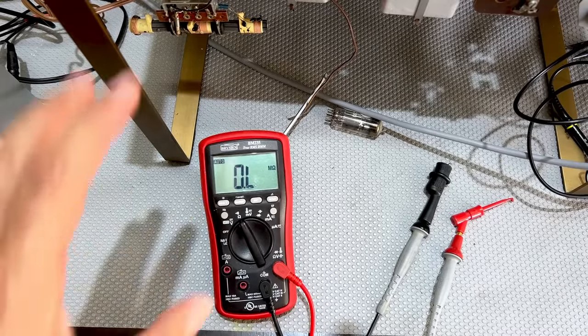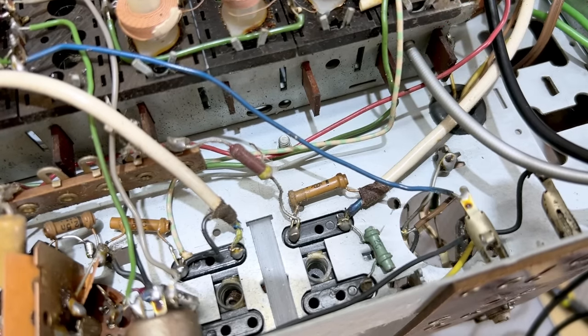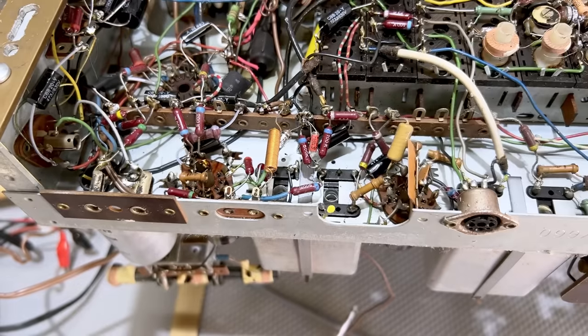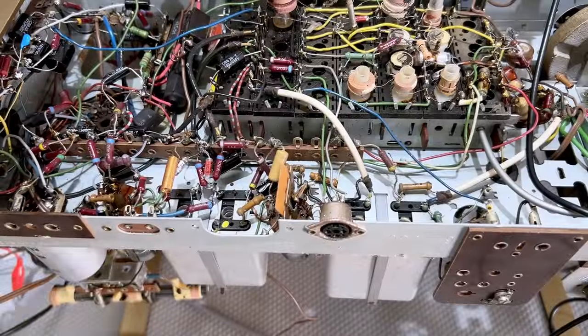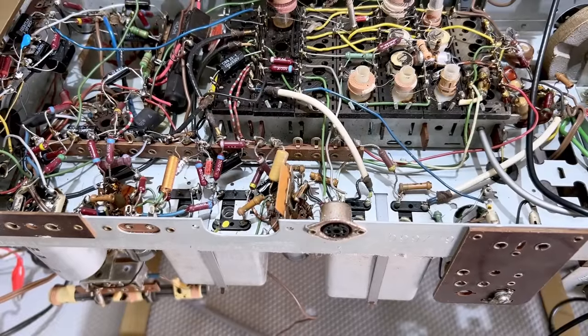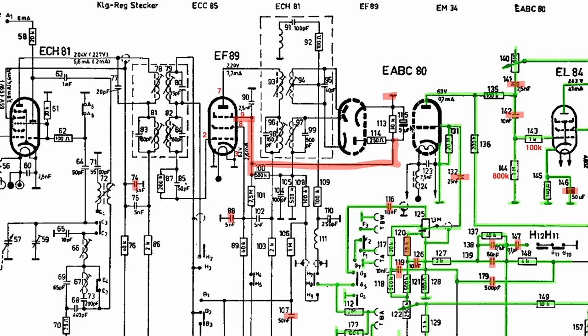That probably should teach me a lesson — when you start assuming things, like assuming that dog bone capacitors never short out, well, they do happen. I'm going to replace that cap with a 4.7 microfarad 50-volt electrolytic from Panasonic and see if we've improved anything. I've replaced that capacitor, switched it on — medium wave, ferrod antenna, maximum volume — and I still get bugger all. So now I've got to think again what could be wrong. I've replaced the tubes, made no difference. It's just buzzing. The screen grid is no longer shorted to ground, but still no reception.